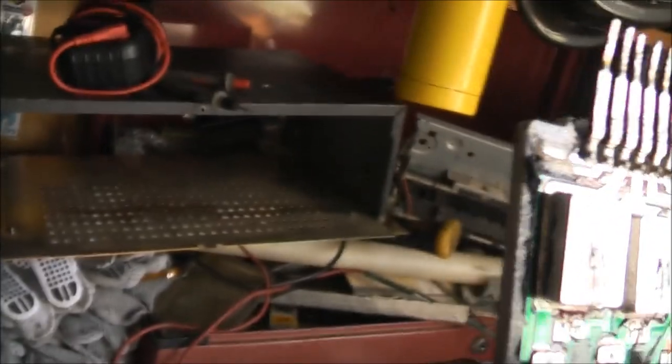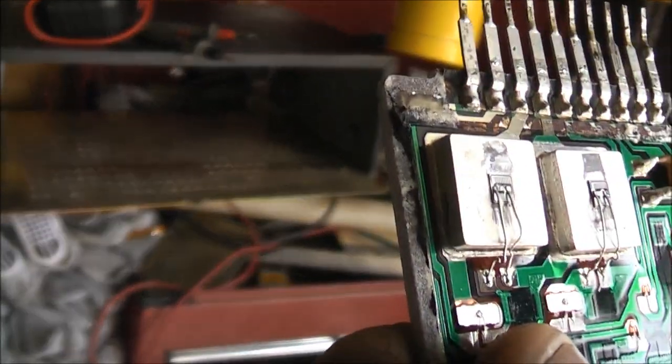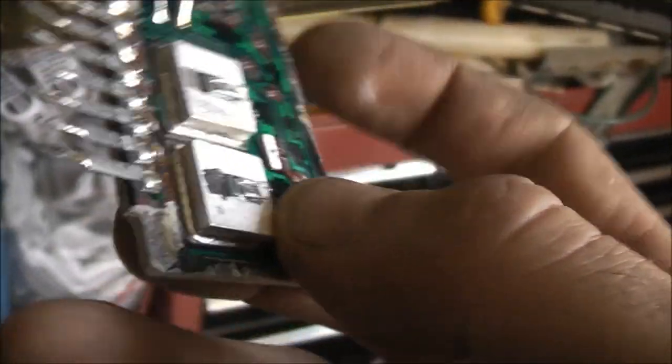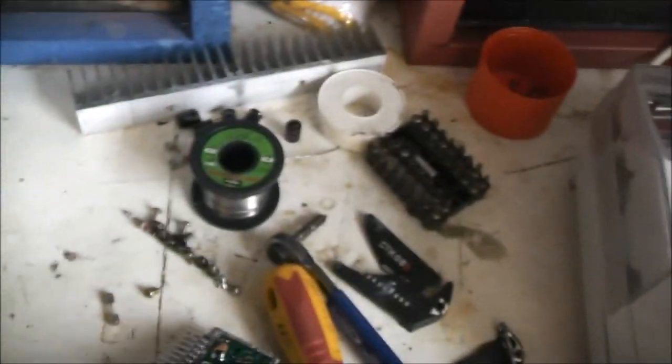The camera's not going to pick it up, but if I carefully look at this — we have a short on this one. I can physically see it. There's like a bit of split copper in there between the leads, and they'll die.